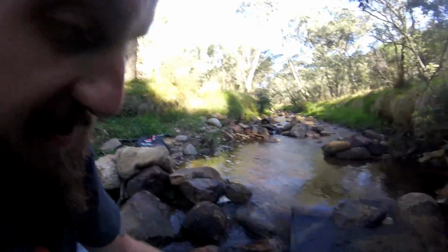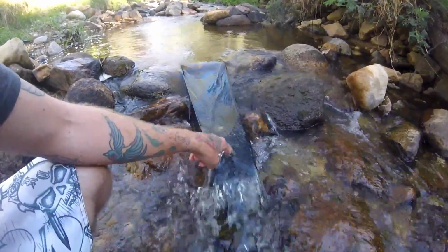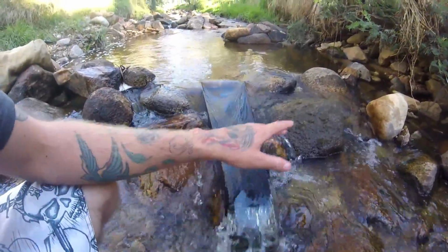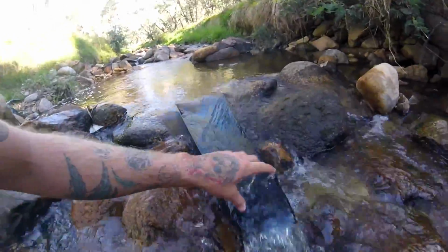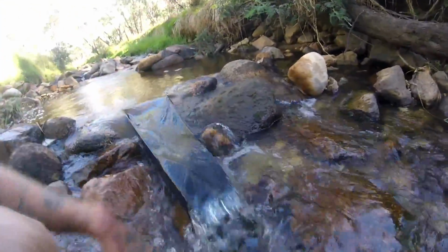The second thing is the high pressure point is right over the slick plate, right where you want the rocks to come off the end. This might need some adjustment. Now, what I was doing originally was having that end of the sluice here. So it would have been feeding down here, and it would have been building up speed, but I had to have the angle to get it to clear.